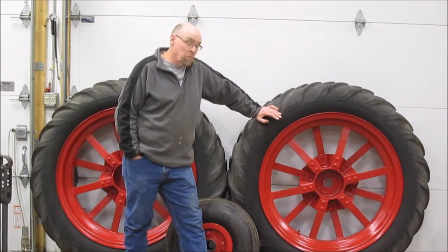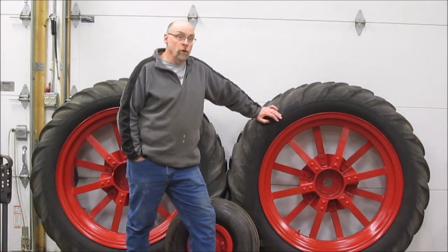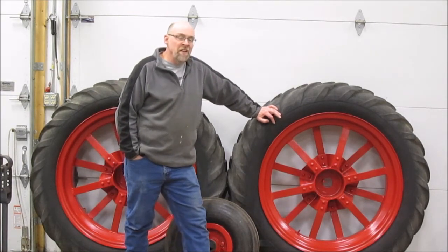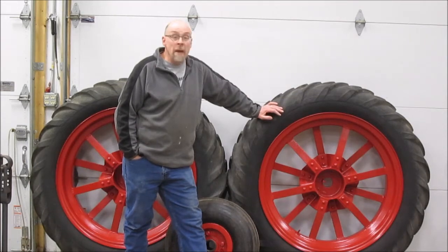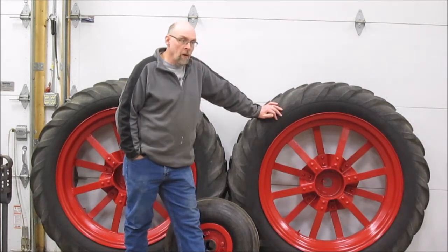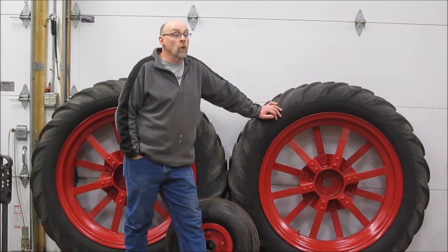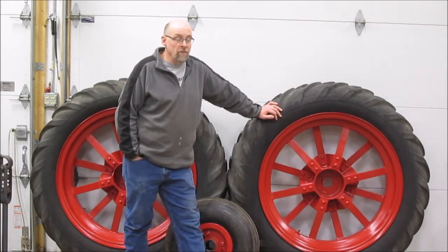The truth is that it sprayed nicely once I had it figured out. And like I said, I should have either put the 2 coats on the same night, or I should have waited 48 to 72 hours before applying the second coat. One of those 2 would have worked, maybe both of them would have worked. I don't know. I know that when I paint the tractor gray, I'm going to paint the primer one night, and then the next night I'm going to come back and I'm going to shoot both coats of gray in the same night and walk away from it for several days and leave the heat on in the shop.